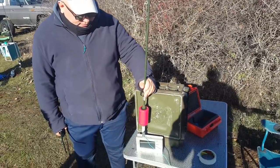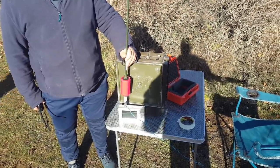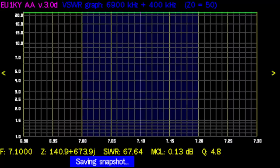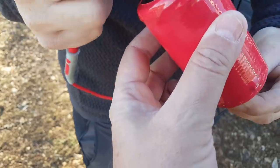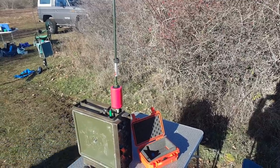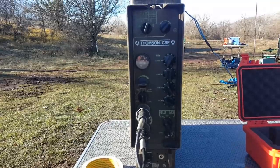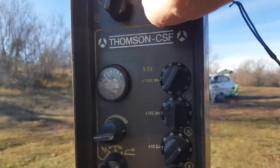So Patrick is holding my antenna here and I'm ready to test with the antenna analyzer. I'm not expecting this coil with the antenna to be resonant exactly on 7 MHz, but we'll see — if it's close enough, that's good. Infinite SWR on 40 meters — that's not good. Might be the adapter that's not working; the contact might be too thin for the connector. I plugged it in — SWR of 20 to 1. It's just not good. I don't understand — the connectivity is good. Reception seems to be good. Apparently there's a contest going on. I'm tuning it now, but there's practically nothing output.